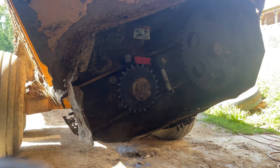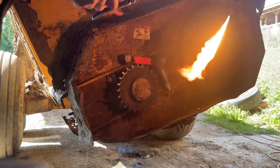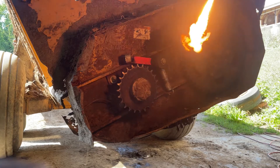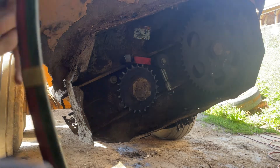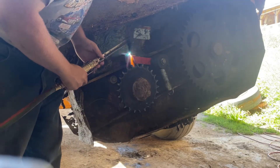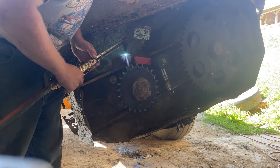One and a half turns on your acetylene, and you can open up your oxygen all the way. I'm going to light off our acetylene here. Put my eyes on. Get her up to temp — we're just going to heat this up a little bit, get her nice and orange, so it'll fix that old bending heat.